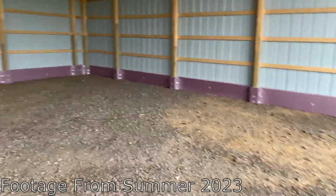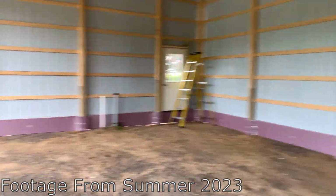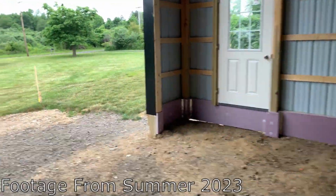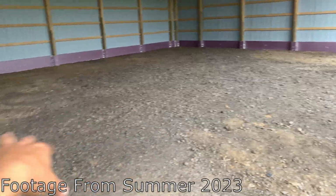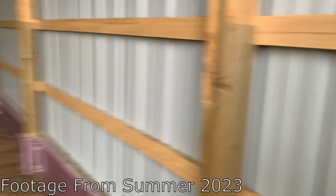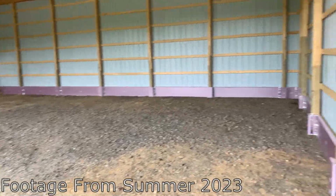But yeah, I got everything cleared out of here. There's a whole bunch of wood over here, a whole bunch of stuff over there. I got my GoPro mounted up there for the time lapse. It's gonna be the last time this place has a stone floor, because the stone's gonna go down 4 inches of stone, then the vapor barrier, then 2 inches of foam board, and then I'm gonna do the PEX piping install. I have to install over 1/2 mile of piping. Final footage of what it looks like before we start the next round of improvements.